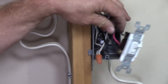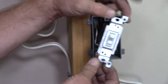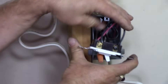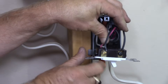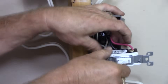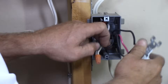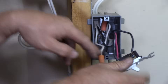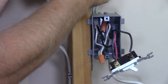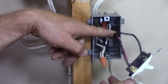Here's the other end of that three-wire cable — three wire plus ground — with another three-way switch, same principle, different style. This is a toggle switch. On this side you can see we've got the black common and a black traveler. Flipping it over, we have the red wire traveler on the other side. The black common is connected to a two-wire cable which goes up to the light, and the travelers came in on the three-wire from the other switch location.